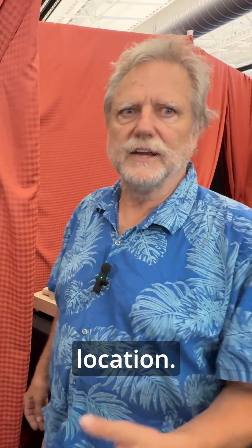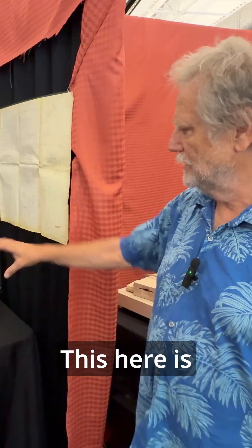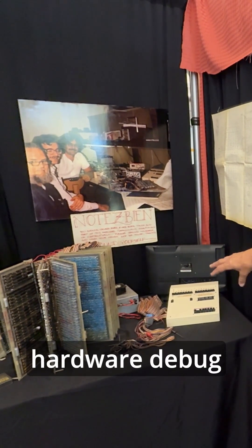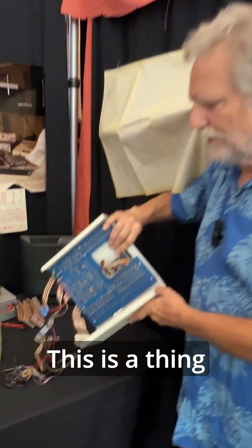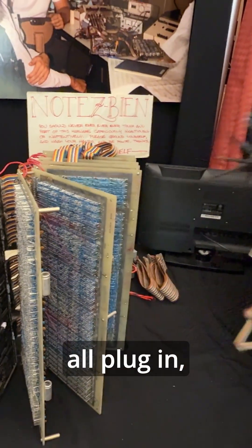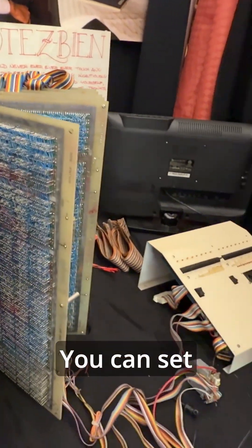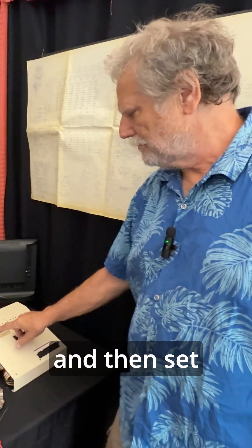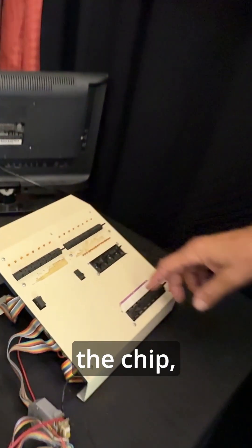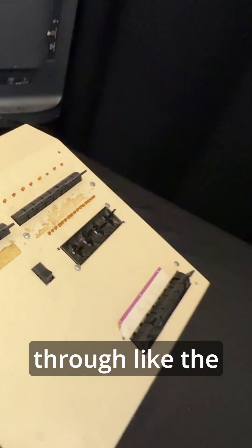We would start them from a particular location and they would display stuff on the screen — it would run the demos. And this here is a hardware debug station with our custom-made — this is a thing for testing Agnes. So these would all plug in, or you would clamp them onto different signals in here. You can set values into the different registers and set certain bits in the chip, and then do a single step that would go through the state machine.